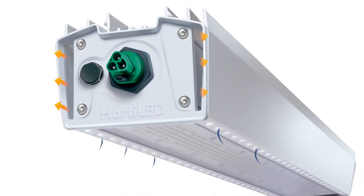The thermally and mechanically engineered design of the luminaire enables convection currents to draw cool air into the slots along the bottom of the luminaire. The air then passes through the channels along the sides of the luminaire, drawing heat away from the LEDs and driver.